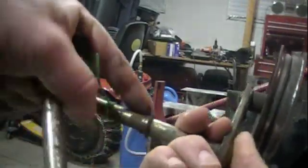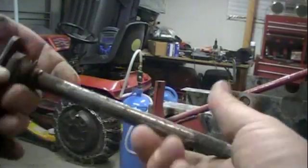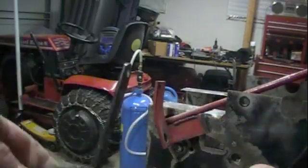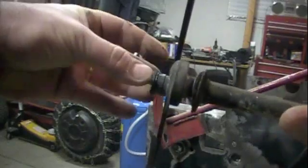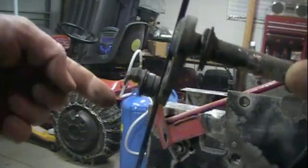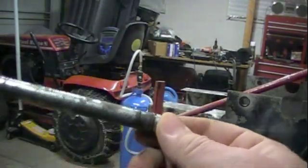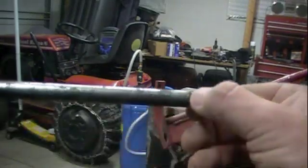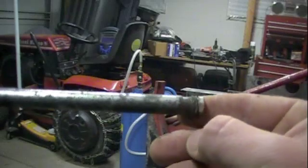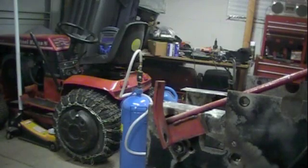You'll notice the bushing. Here's what they did — they let the bearing fail. This goes inside the tractor; the pulley would actually be down here. The bearing fails and the pulley wears into the nut that's holding it. As I showed in the other video, you can see where the pulley outlined is there — it put such strain on the end it actually cut a groove. That groove has got to be a sixteenth of an inch deep, if not almost an eighth of an inch deep. It's really amazing what you find on these tractors and how people abuse $5,000 pieces of equipment. I guess that's why a guy like me restores them.